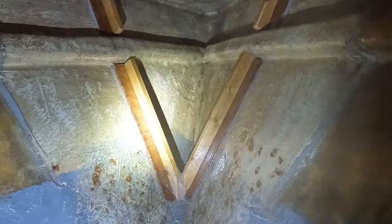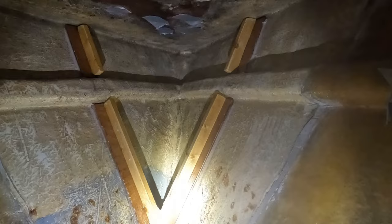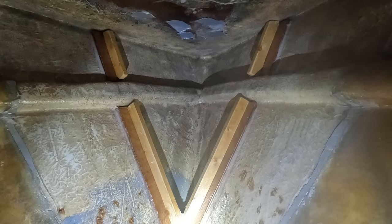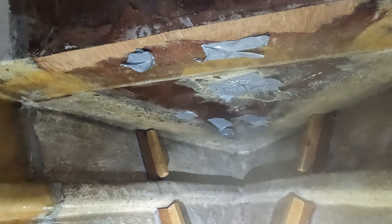Apologies if it's a bit flickery from the LED light, but you can see we've now got these side pieces epoxied in, fastened with thickened epoxy. They will give us both the spread to avoid hard points on the hull and also something to push the bulkhead against. We'll probably do one bulkhead section up to stringer level, an overlap behind it, fill with expanding foam, then put the smaller part on top and fiberglass across the whole thing. You can also see the tape on top there — we've filled all the holes from the anchor locker, so no more water coming in here. We've got it up to 22 degrees in here so it should set quite nicely. That's all for this weekend — thanks for watching, and if you enjoyed it give us a thumbs up.